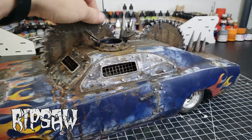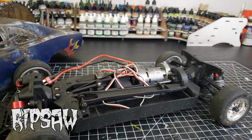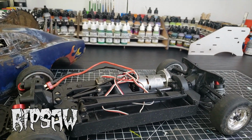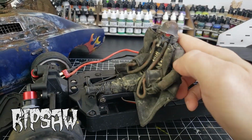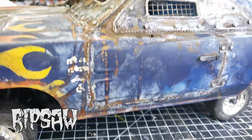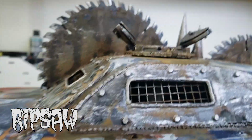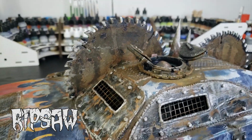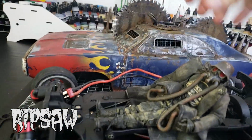because it's a pretty tight squeeze in there. Right where he needs to sit is where the battery lives in this chassis, and that's gonna pose a real problem. Now, we could sit him on top of the battery hold-down strap. That's an option, just mount him right up on top of there, but he sits way too high in the chassis. I mean, his head literally sticks out of the hatch in the roof. So that's really not gonna work. What we're gonna have to do is sit him down in the battery tray.